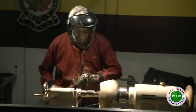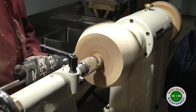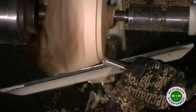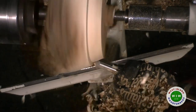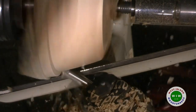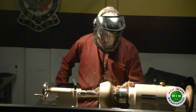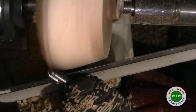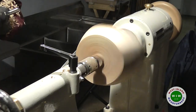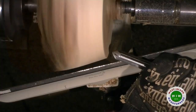Bill and I have watched Stuart Batty's recent video on bowl turning with this gouge, and the amount I learned watching that video is unbelievable. It comes highly recommended. Interesting bit, because you're cutting for maybe 15% of the time. So you can't force the gouge against the work. If you do, you're going into the air gap. And then the piece of wood comes around and clobbers you.